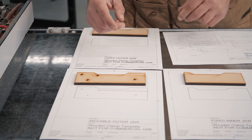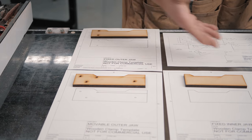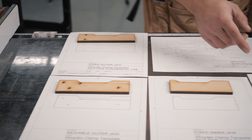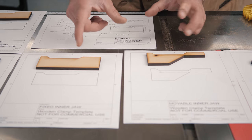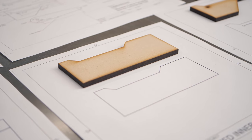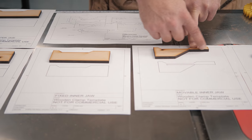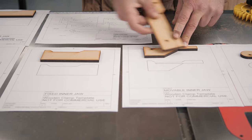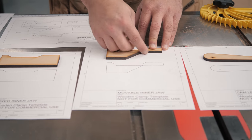I'll be able to use my Katz-Moses no deflection universal stop lock for that. And we should be able to get perfect rectangles using just the table saw. And then where some tracing is gonna come in, we're gonna move over to our center pieces here. These are slightly different widths, so you can't cut these the same width because of how they interact with the square steel tube. So what I'll do here then, this cutout doesn't matter either, except for this line. You want that to be pretty exact, because when you release the lower jaw, when you cut this line here, which is also marked on the templates, then you want that to be free. You don't want it to be glued down.